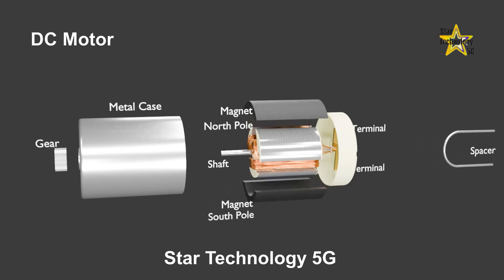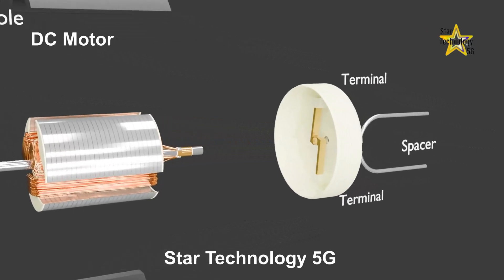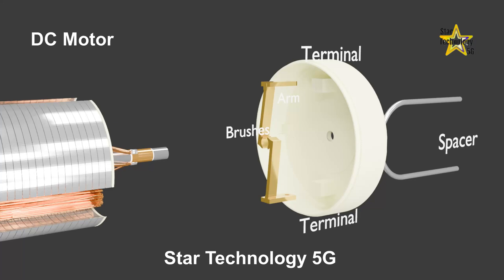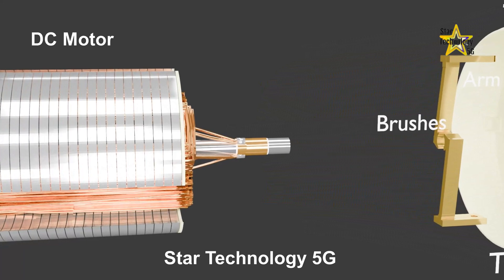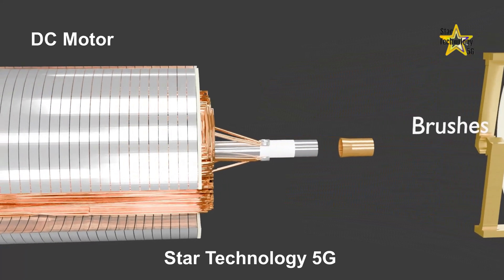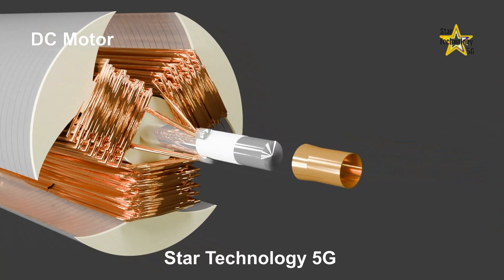If we remove these two magnets, inside there is the rotor of the motor. This is a plastic cap with two terminals. These terminals are attached with arms, and arms are attached with brushes. The purpose of the brushes is to provide electrical supply to the commutator. This is a commutator, commonly constructed of copper. This commutator ring is split into three segments: Segment 1, Segment 2, and Segment 3.